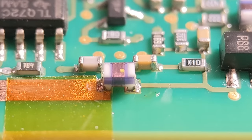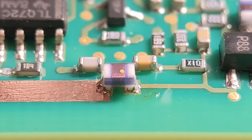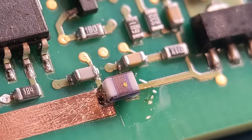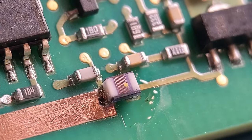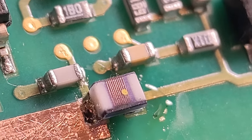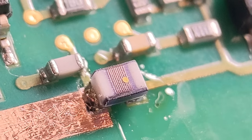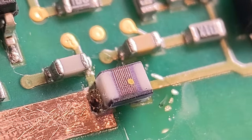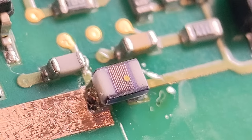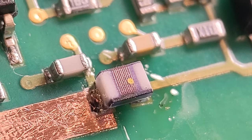Hopefully the Kapton's done its job. I'll quickly peel that off. As you can see — just going to zoom in slightly — we've got no solder going outside where the Kapton was. That's a great result. That's how to keep your solder in the desired area. I've cleaned this up and will put the photos up after. The Kapton's done its job in keeping the solder where it should be. I've just got one more short demo to show you, I'll put a few more photos up, and then move on to the last one.